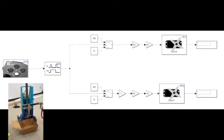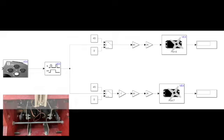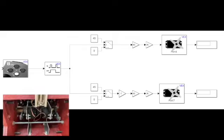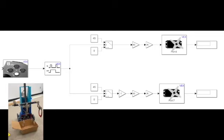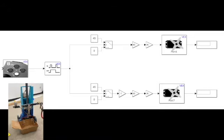We used 2 of our 3 remaining servos to grab and release our cardboard detachable part that is meant to hold and dispose of plaque. These are operated by the 8 down button, and the same code is used as with the claw servo, except that it is sent to a pair of servos rather than a single. This pair of servos has a different range of motion than the single servo does.